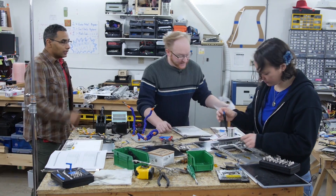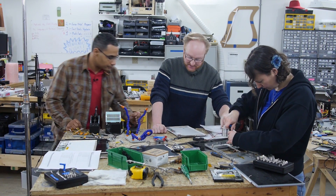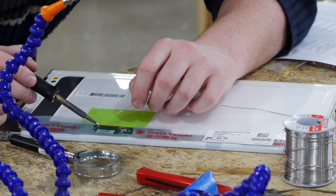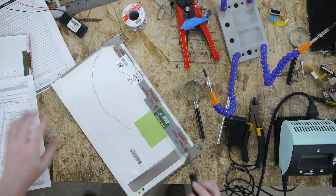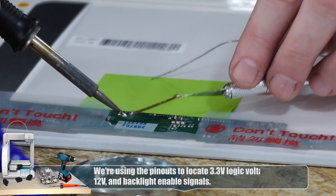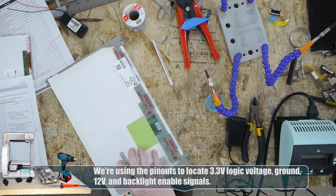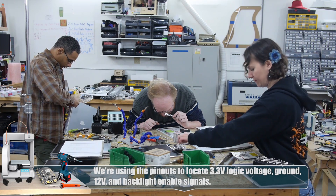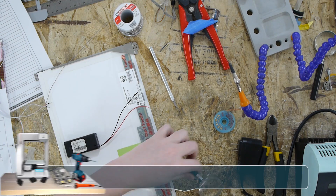This LG screen here looks a lot like the ones we used on our pinball machines — which I have the pinout for already! I'm going to mostly remove this header. It looks like the pinout matches, although this might be a lower resolution panel. The PWM and the on-off control are right next to each other on this one.